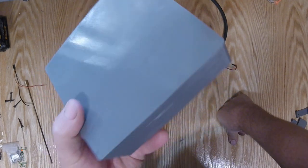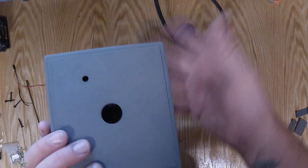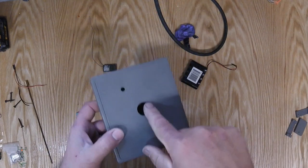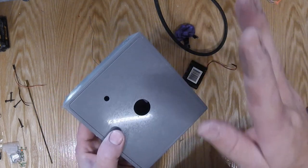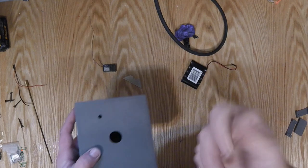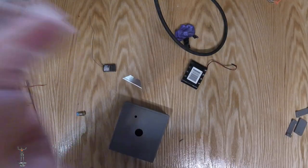These that I made work really, really well — they do not leak at all that I've noticed so far. They've been underwater and seem to be pretty good. But let's just assume you get 15 drops of water in your radio box — it's not the end of the world. You can run all day on that. It's not going to hurt anything because your servos are waterproof, your receiver's going to be waterproof. The problem is when you go to store your boat, that water is going to evaporate, cause condensation, and get connections rusty. So instead of having to untape your whole radio box, I'll show you my drag cap.